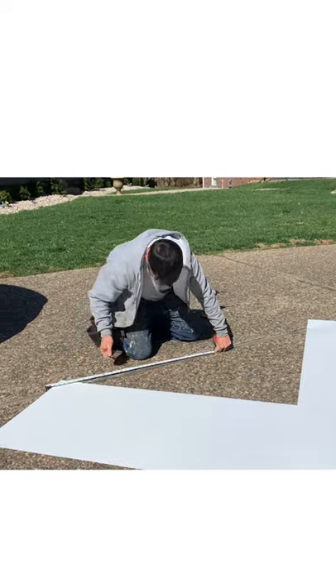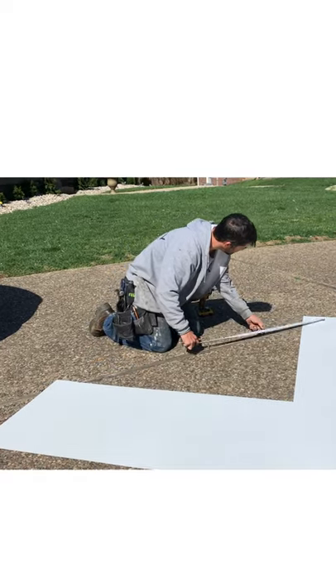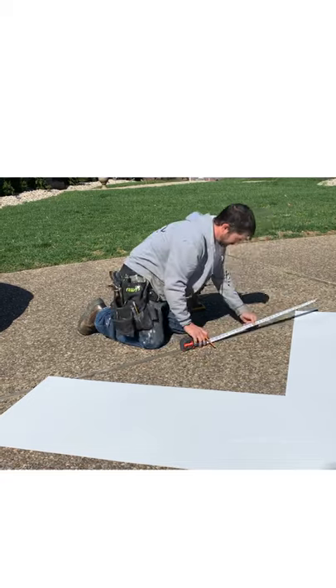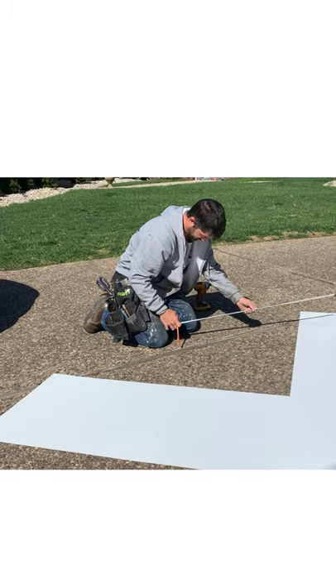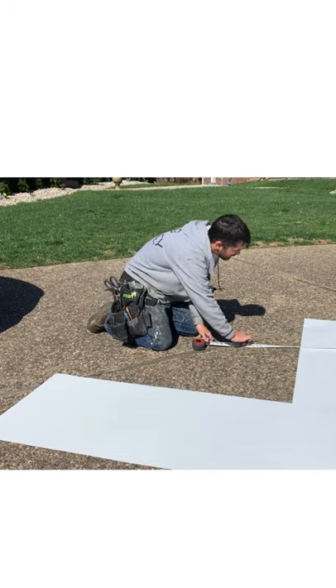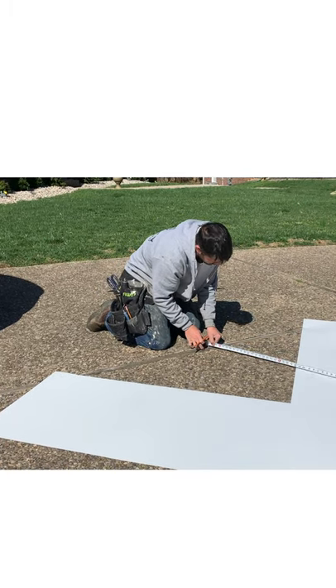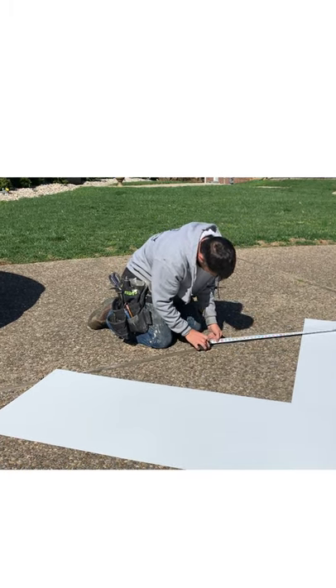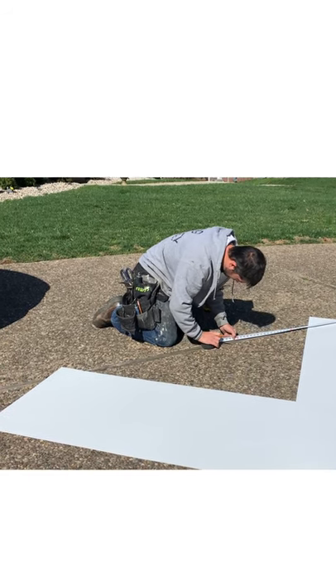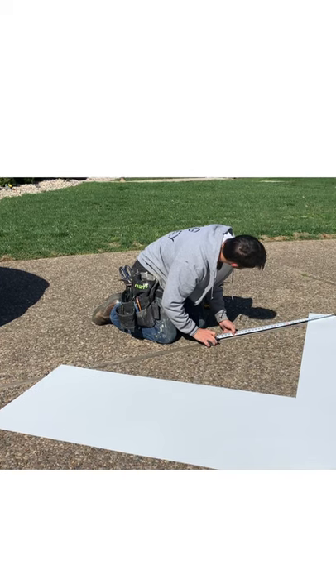You want at least 5 inches from your outer edge of your total width. So I got at least 5 inches there. Then I mark my center. I'm going to lock my tape at the center mark — I have a long screw in the board right there so I can rotate this tape and trace this arch out. I locked my tape on the halfway mark.